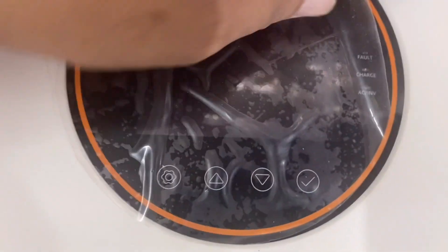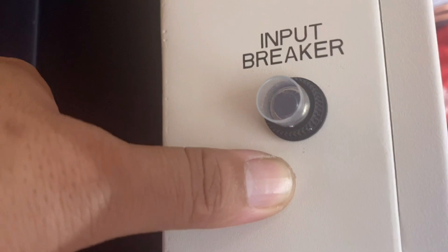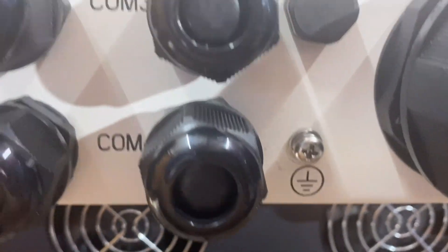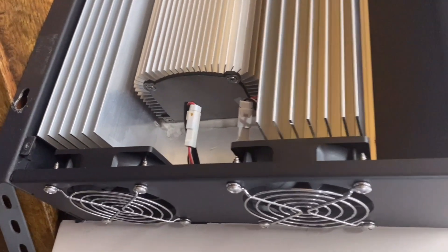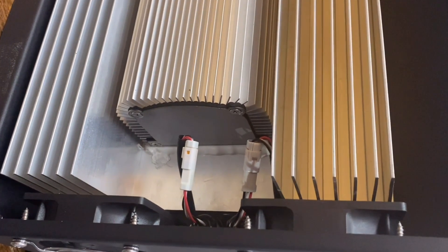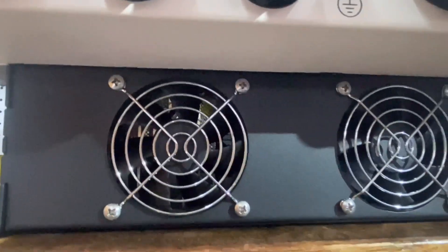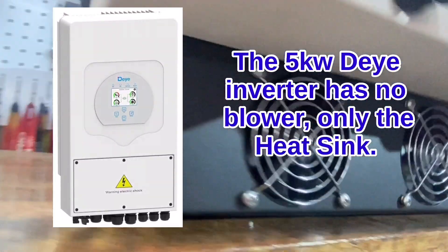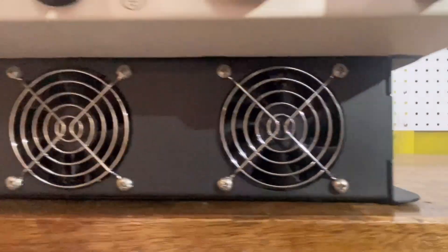Let's remove the plastic cover. On this side is the overload protector — a push-type button, though no amperes are indicated. This inverter also has a chassis ground screw where I will connect the ground wire later. Inside, there is a large portion of heat sink to dissipate the heat, and it has two fans or blowers to help cool down high temperatures. It absorbs air from the bottom and blows it upwards. This setup is better than the 5 kilowatt inverter, which consistently gets higher temperatures during peak solar harvest because it only has a heat sink to dissipate heat.